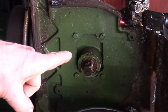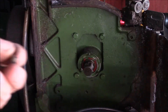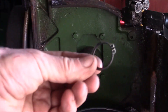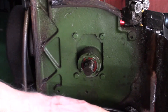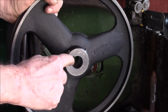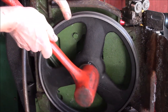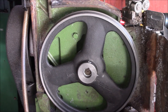Here we have the bandsaw with the old broken drive wheel pulled off. I've got the 6×6×25mm key and the retaining ring off the old one. I've applied a little bit of anti-seize on the shaft and also on the two set screws — one set screw for the shaft and another one for the key. Getting it lined up, the old one was busted so it just plopped right off, but I may need to file or sand the old shaft a bit.